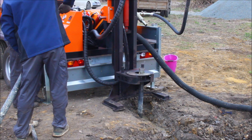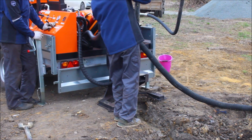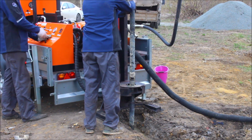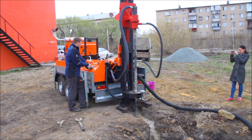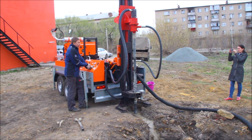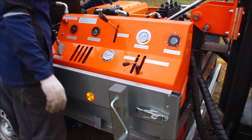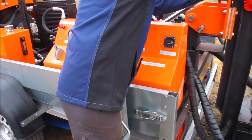After the three blade bit is drilled down, you need to install the first 1.5 meter drilling rod. After this, you start to drill the first drilling pipe. In order to control the movement of the carriage, you use the lever for carriage travel.